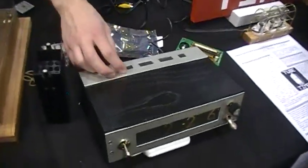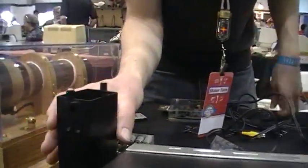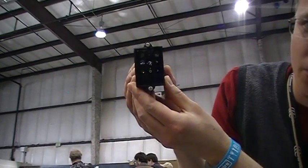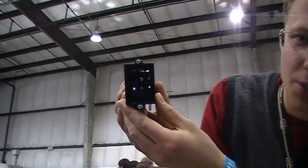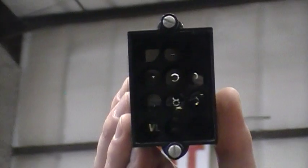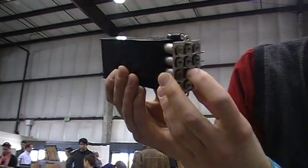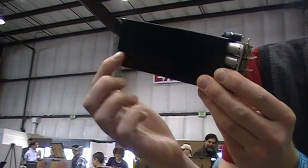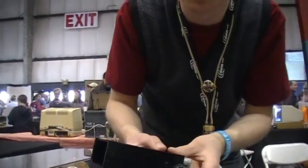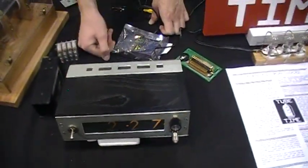We could go to this one right here which uses IEE displays. These are rear-projected displays. So there's lenses behind here — if I hold this up to the light you might be able to see numbers shining through it. There's lenses in there and behind each lens is a little mask that has a number printed on it. We take this little array of light bulbs that fits inside here, and those project onto a little screen on the front where the number shows up.